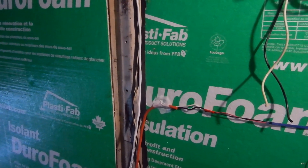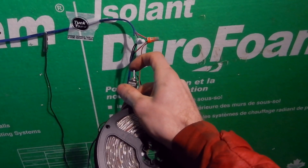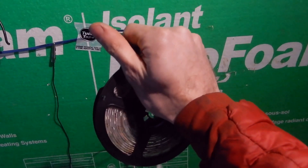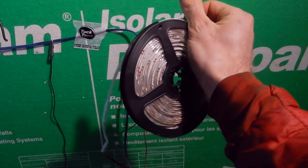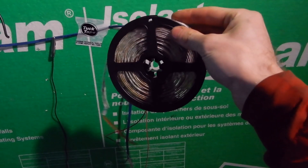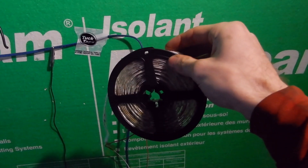There's a whole host of wires which come up this side and go off to the fan and lights, but over here I've wired in this switch which will be hooked up to LED under-cabinet lights — both in the kitchen and the desk area. I've just roughed in the wiring for now because they're a little finicky; you have to cut them to exact size, so I'll add them once the cabinets are in place and I can take exact measurements.